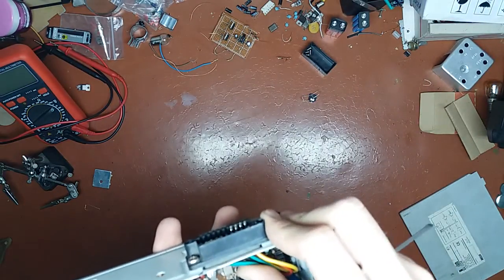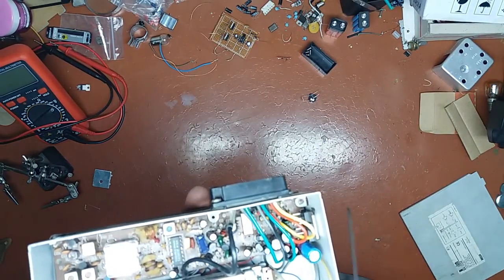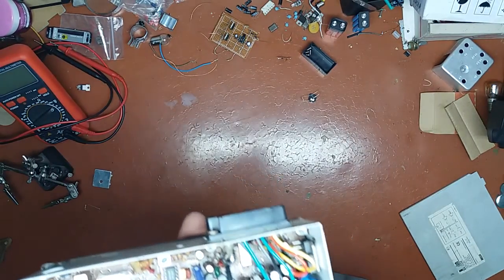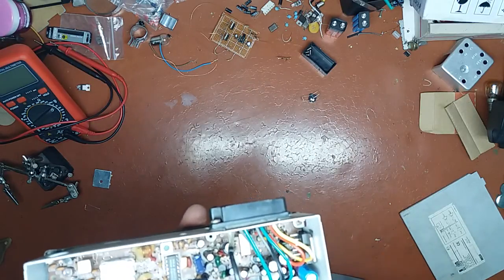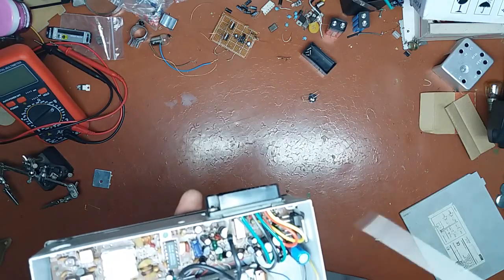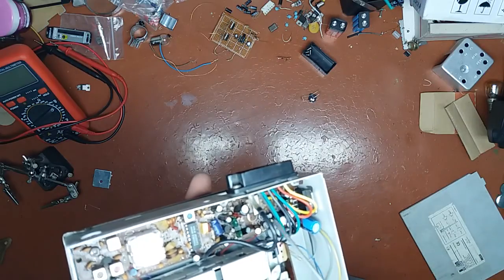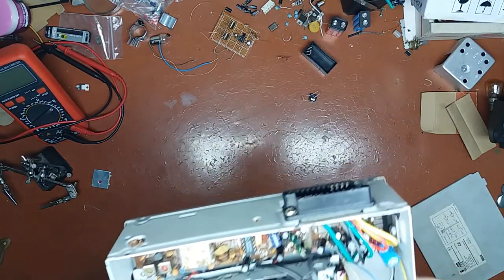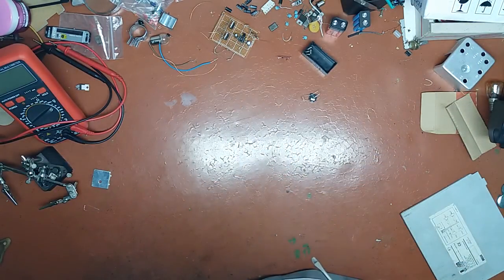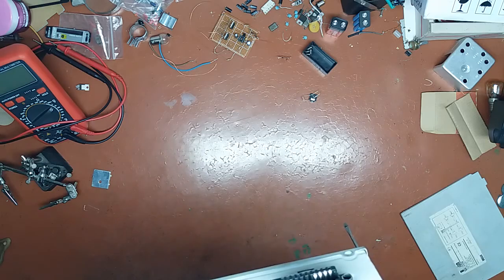I was puzzled when I heard that, but I then went in and traced the circuit, and yes indeed it is a choke. It's a really small choke, and I never saw a choke on the rail on this EI type of core, which gets kind of ridiculous. And the wire that it is wound with is a rather puny one. It's like 0.3 millimeters in diameter, not huge.